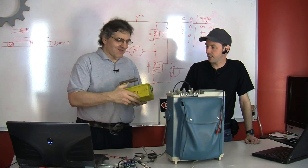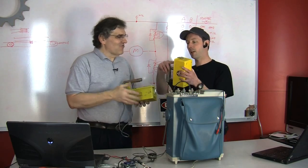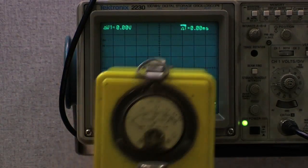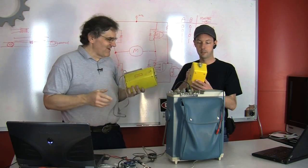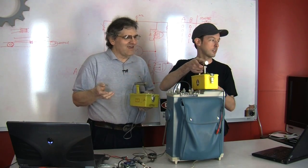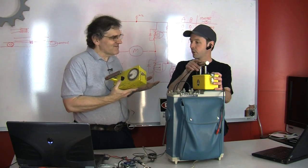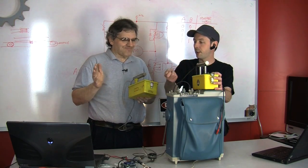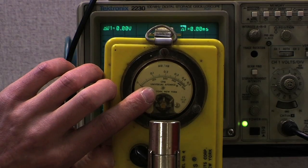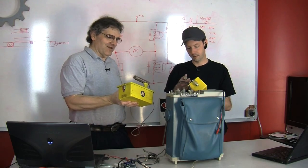We have two survey meters here — Geiger counters. Well, these things don't count anything. Actually, they do have a meter on there — millirems per hour — and a counts-per-minute scale. I'm going to pull the schematic out in a bit; there's a little integrating circuit in there. They were made in the 50s and 60s, so basically it's just a 'you're going to die' kind of thing. This one is a Victoreen Instruments Company Model 6B, and yours is a Universal Atomics Model 4.